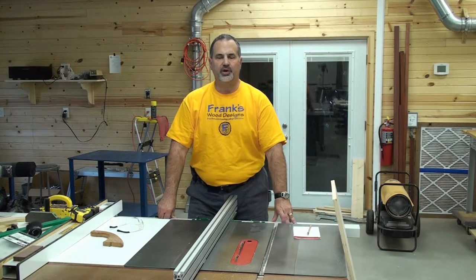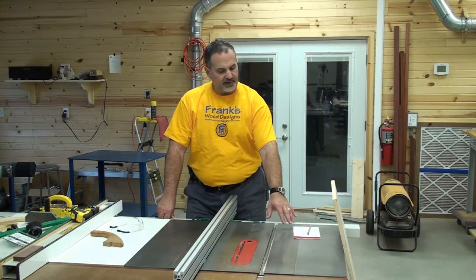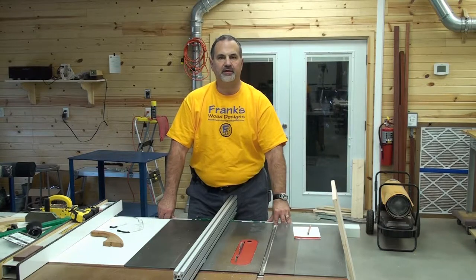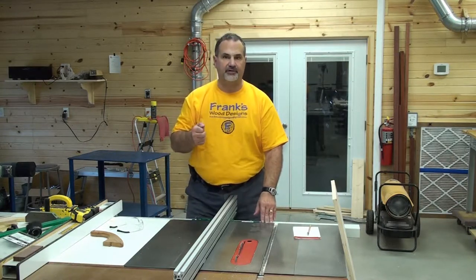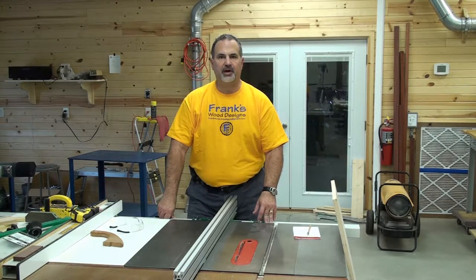They're the pony 3/4-inch pipe clamps, and I want to make a rack for that as well. So the width of the rack is going to be 42 inches for the area of the wall that I'm going to apply this to. And I'm going to make the board 5 inches tall. That gives me enough room to rest the clamp on top of it.